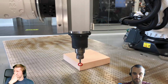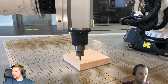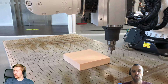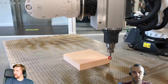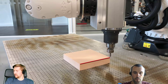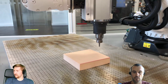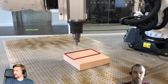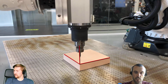Cool. So now look at actually setting the WCS. What are we using here, and why are we doing it? Everything we do in robotics in terms of this type of jobs, we're doing a relative job, relative to a coordinate system. So what we're doing is defining this coordinate system on the part. Previously we calibrated our tool, or we confirmed the tool is a known length. And what we're doing here is measuring 3 points. The first point was the origin. Second point was on the other side of that edge. That defines a line. And the third point is on the XY plane.